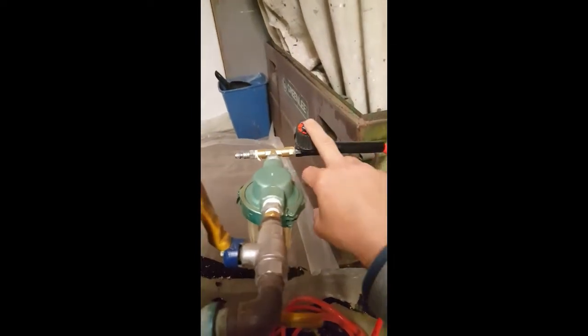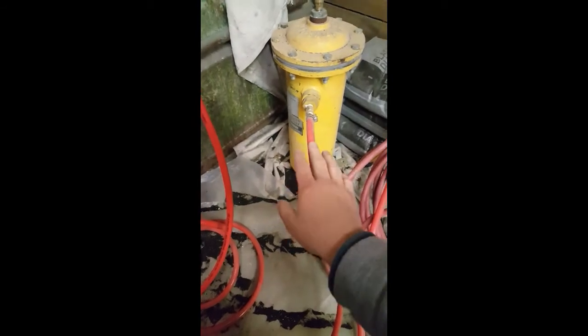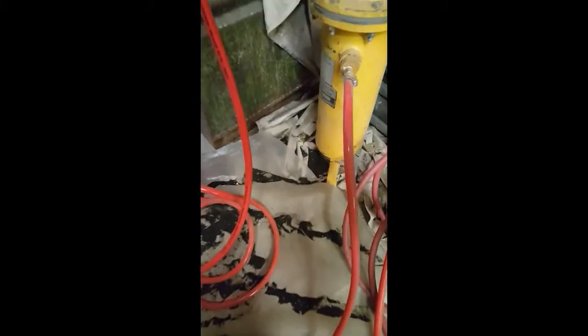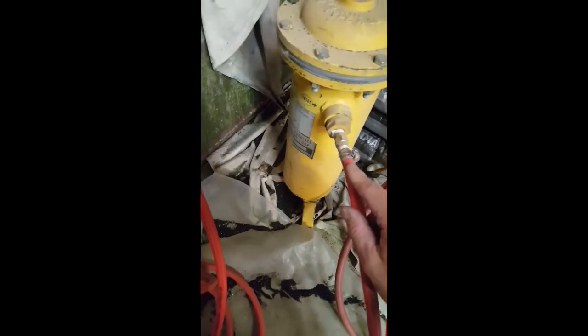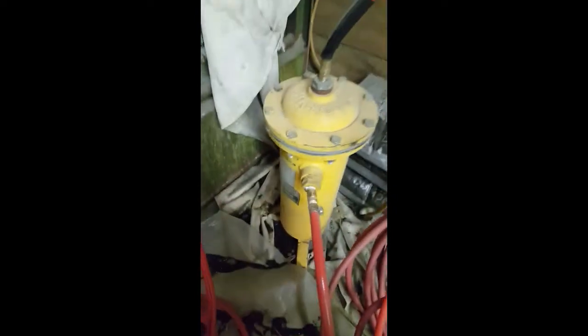My air is going to come in on this fitting to my sandblaster, and this is just another Harbor Freight regulator. I put about 5 psi or less to this filter. This is the same airline — the 50-foot that I cut down. I only used 10 feet when I could have used probably 2. It has a barbed fitting on this side, three-eighths into a quarter-inch thread that runs into the filter, then comes back out the top running from that same airline to my helmet. Too much linear feet, but it's not hurting me.